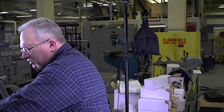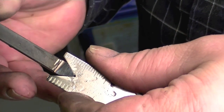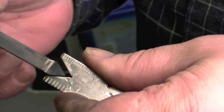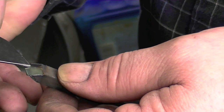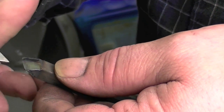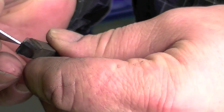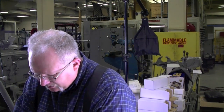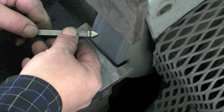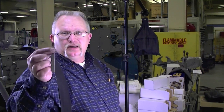There are some things people do wrong with this tool. One is too much slop, which means you need to grind away the tip as I did earlier. Another thing they do is faceting — let's make that one solid grind top to bottom. And another thing: they don't remove the burrs on the end of the tool. Let me get rid of that burr. I do that just by working it back and forth edge to edge, one edge then the other. Now we have a tool that will cut threads. That's how you do that.